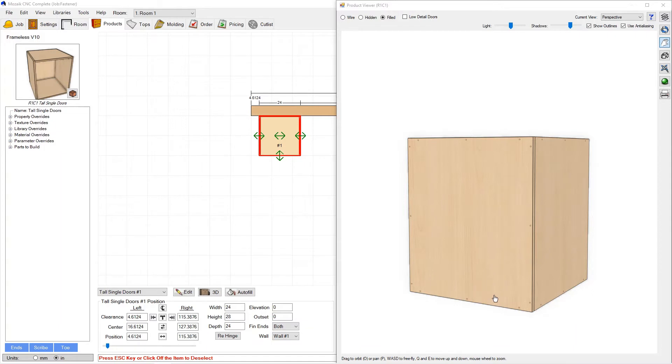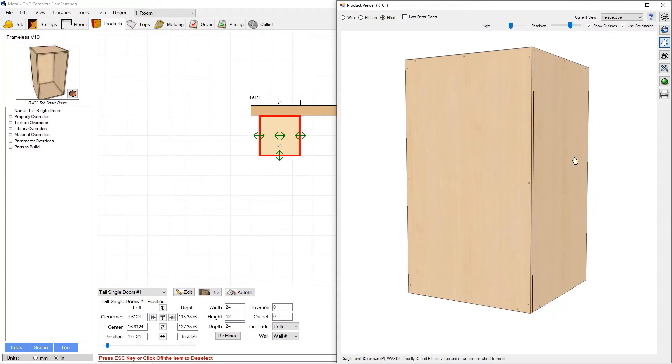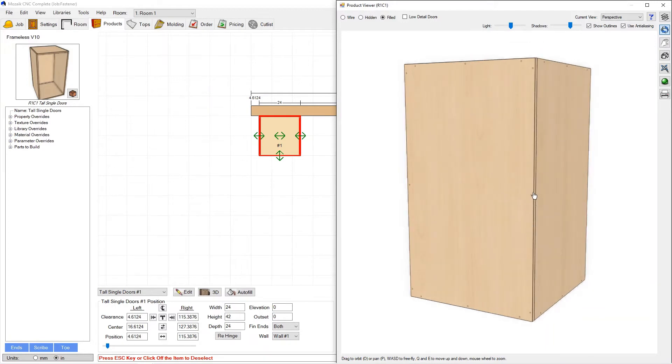Starting in Part 1 — I've got this 28 inch sample cabinet from the intro with three holes. If I go to a taller version, say 42 inches, it's still centered and fine, but when a joint is that long I'd like four holes. What we're going to set up is making this joint smart so it knows when to switch from three to four holes and ensures the spacing is correct.